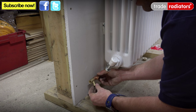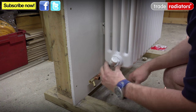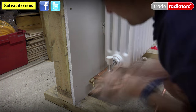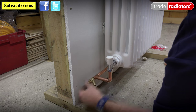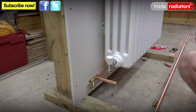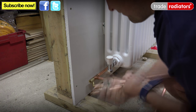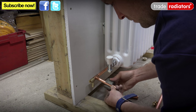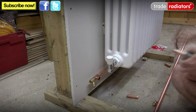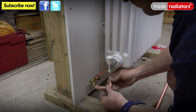I always twist my drain off slightly away from the wall so if anyone's going to get a hose on there it's nice and easy for them to do so. I always remember something my old man always said, and that is: a thing of beauty is a joy forever. So make sure that when you are installing your pipework you get everything level. If you need to cut a sliver off the copper pipe to make it look level or square, then it's best you do that now rather than soldering it up and the customer or whoever you're doing the work for looking at that pipework and being annoyed.